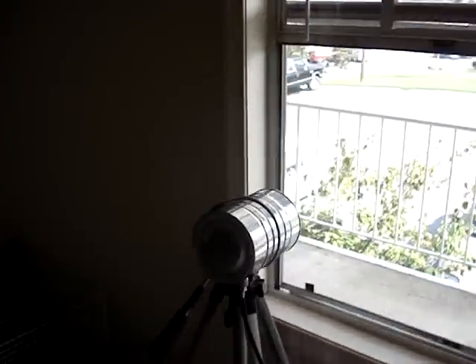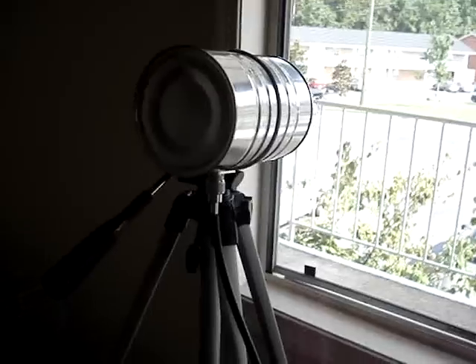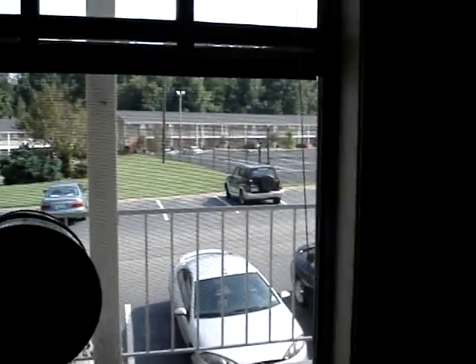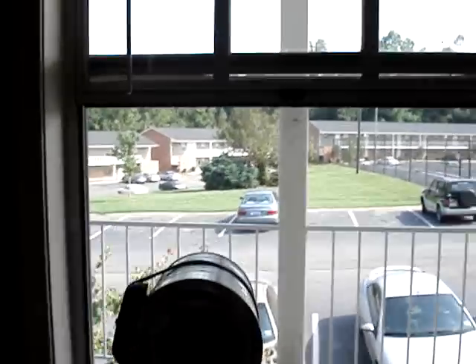As you can see, the connector is in a vertical position. It's linearly polarized, so you want the antenna inside the can to be the same as the antenna from the sending point, but you really don't know since it's somewhere in one of those apartments. So I just put it vertical — I figure that's most likely.